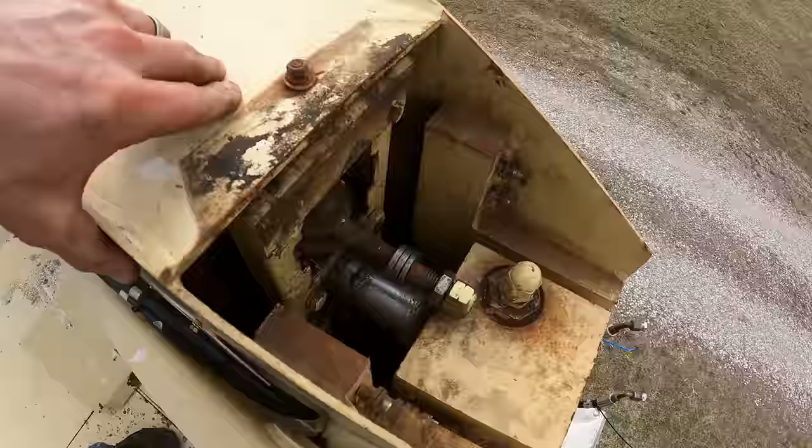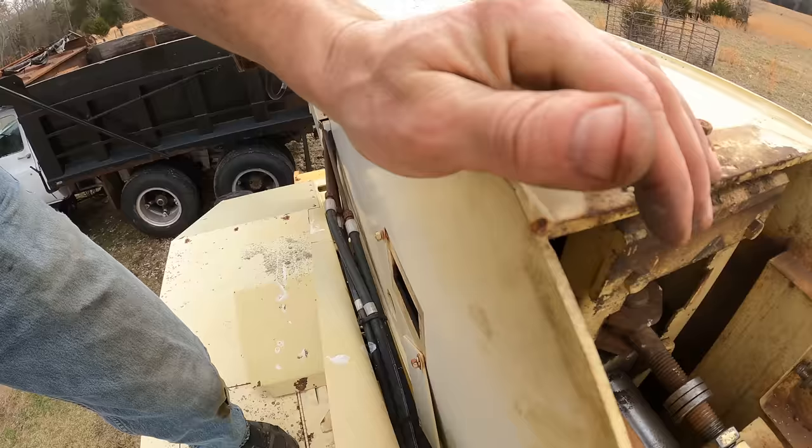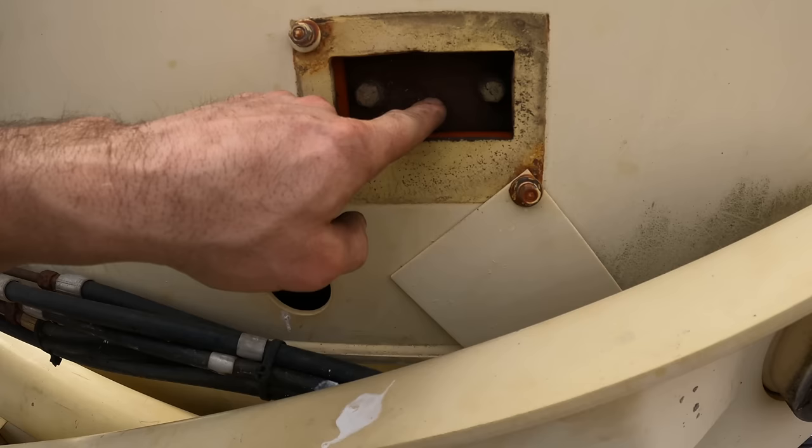So there you can really see the rod now. And up in there where it's orange is the mid boom. Well, the mid boom attaches to that cylinder with two pins, one on either side through here, that I need to pull out. They're under this plate.